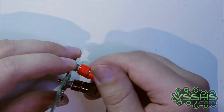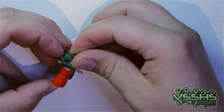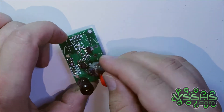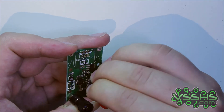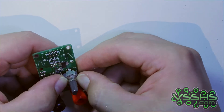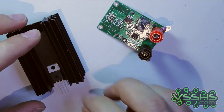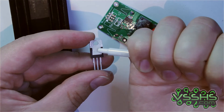The Reload 2 is an adjustable constant current load. It was quite cheap — I paid $30.35 for it, with $5.35 of that being for shipping, and I bought it from tindie.com. There's also a cheaper version for only $15 plus shipping. Shipment to Denmark took only 3 days. A really cool thing is that it is self-powered and can operate down to 3.3 volts while keeping its current limiting capabilities. I went for the 0–6 amp version since the price difference is minuscule and it seemed more useful.